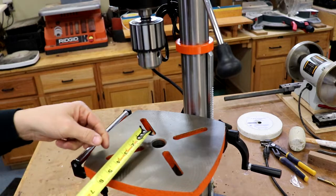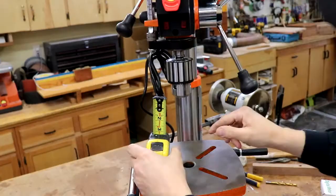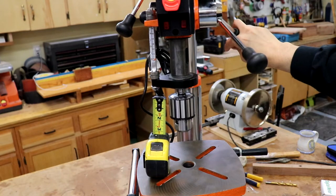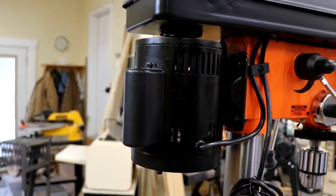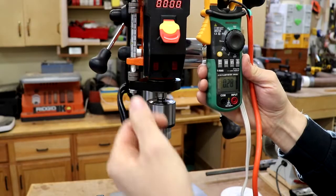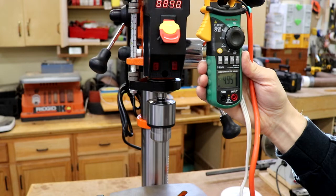The 4214 has a 12-inch swing, which means there's six inches between the post and the center of the drill bit. There's a three and one-eighth inch travel, meaning you can drill a hole that deep. It has a two-thirds horsepower induction motor, which I find to be ample — I measure it at a five amp draw, which is exactly what they spec it at.